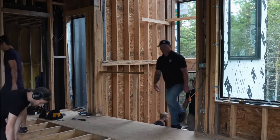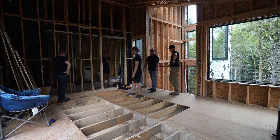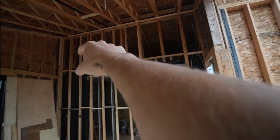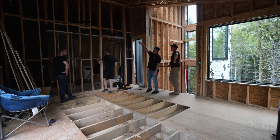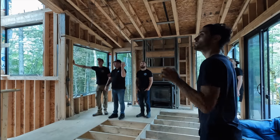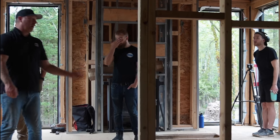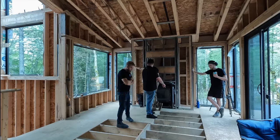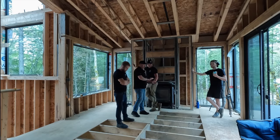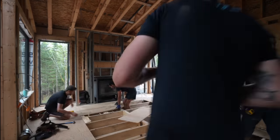Hey, how's it going? I'm working on the plumbing — we got all this up. I wasn't sure of your exact path. I'm going to come down these two-by-four walls here and just tuck your mains in. The plumber's pipes need to pop up here, so I need to cut this open — they need to glue in the toilet, the sink, all the connections along the way. ERVs recover moisture as well, so they're going to have to get in here to run fresh air down and an exhaust. And that is a prime example of why it pays to have the experts in.